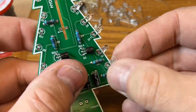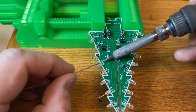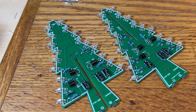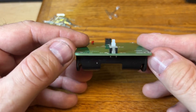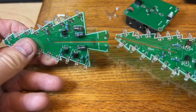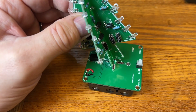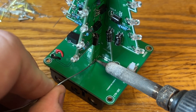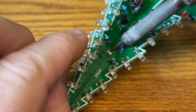It didn't matter which slot they went into — I just had to make sure I had the right polarity. The long lead went into the square pad and then I soldered them from the top, which made it easier. The base was next — pretty easy, just a couple of components and the battery box. I double-sided taped it down because the screws didn't hold it very well. I then assembled the two Christmas tree halves together and slid them into the base. Once that was in place I just needed to solder the connections at the bottom, and there is also a connection in the middle to help hold it together.